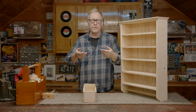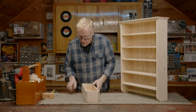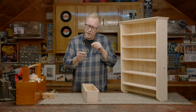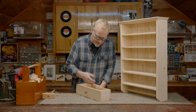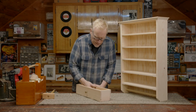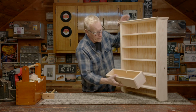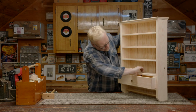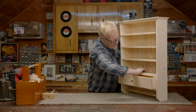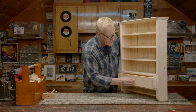Last thing you want to do is pull this drawer out and have it and its contents fall on you. So, a simple popsicle stick, drilled a hole in it, screwed it on with a brass screw and a ring washer, just adds a nice effect. And when you turn it, it blocks against that button and acts as a drawer stop. Put that in there. This is a piston fit drawer. There's no drawer runners, it just fits nicely in there. It's solid wood, so it's going to expand and contract a little bit, so we wanted to leave some room for that.